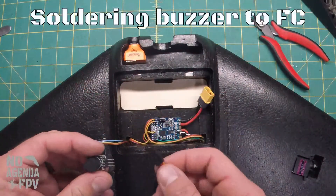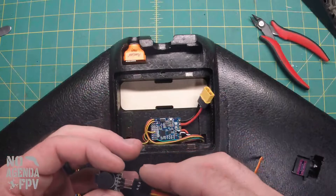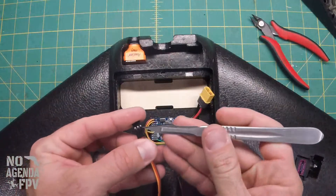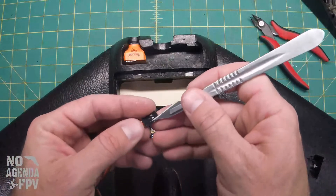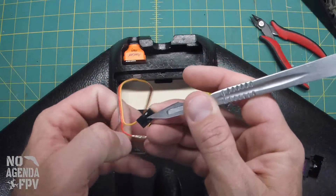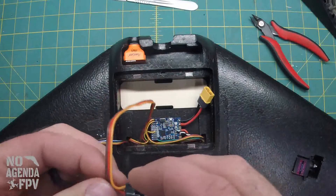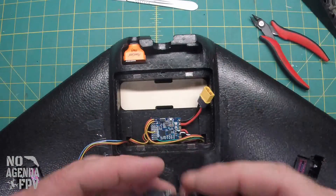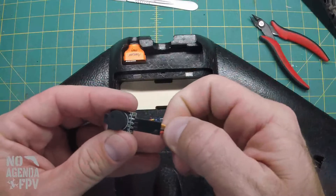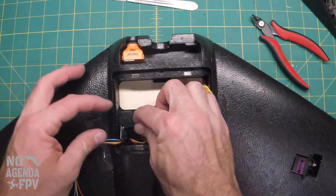Sometimes these wires come in handy — I'm going to use this one for the buzzer. I'm going to redo these pins in here because currently they don't line up. I'm going to swap them — pull the tab up and slide it out. Now I'm going to line up 5 volt, ground, and our buzzer negative. I'm straightening these pins out and I think I'm going to put it up against the wall.